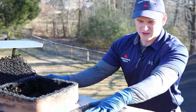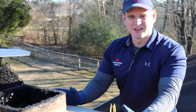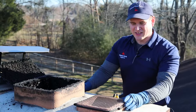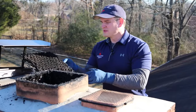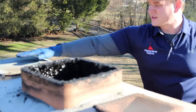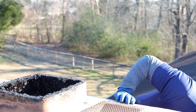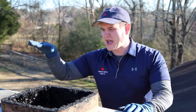We'll also want to do something about these. The reason you don't want a screen just laying right on the top is that animals can just make their nests on it — especially because they like the HVAC warmth from inside in the wintertime, since all the heat is being drawn from inside the house. In the summertime it's cool because all the air conditioning is being drawn through here. So a bird or a squirrel — most likely a squirrel — will make their nest on top. Then when you go to crank up your wood stove or start your fireplace, it's not going to be able to draw. This is why you want a cap with proper screening to keep water from coming in as well.